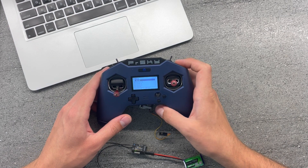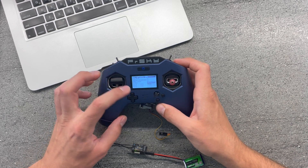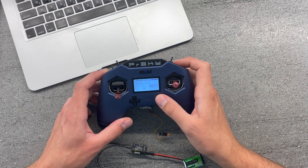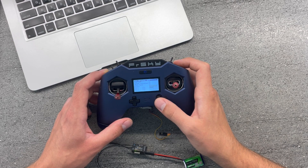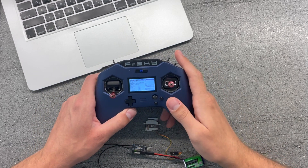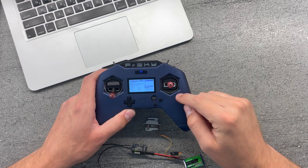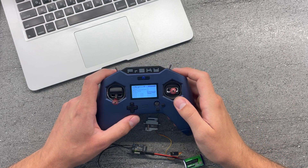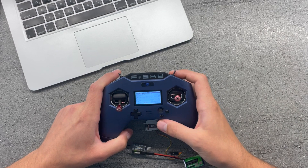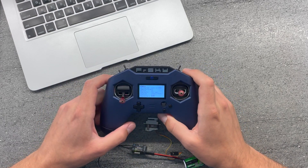Once done, we need to long press on our receiver name and go to Options, then find the Protocol settings. We need to change this to FBus. By default I think it will show as S.Port or F.Port, and we need FBus for our servo to work as a programmable one and to do all the fun stuff we'll do further in the video. If there is no FBus option, you will need to upgrade your firmware on your radio. Just upgrade and that will be available. Then press Exit and update your Rx options.